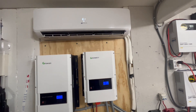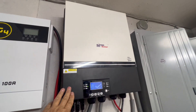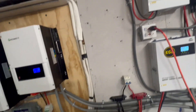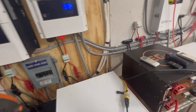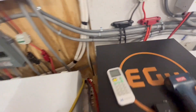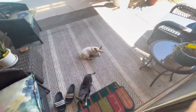So in order to do that, you're going to need the 220-volt mini-split and some type of inverter — this one is single phase 120V only, but you can get ones that do 120/240/220. You'll also need a battery bank, whether AGM or lithium iron phosphate, plus wiring. For the panels, you're going to need about 2,500 to 3,000 watts to run it consistently and keep your batteries charged.